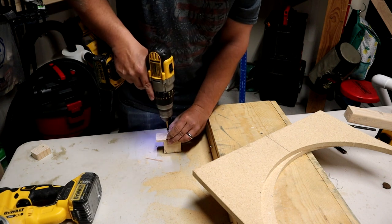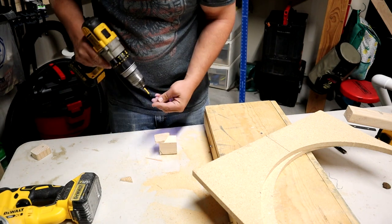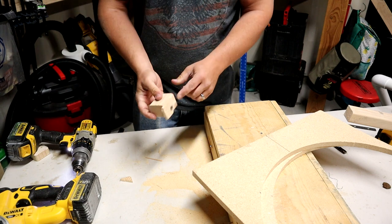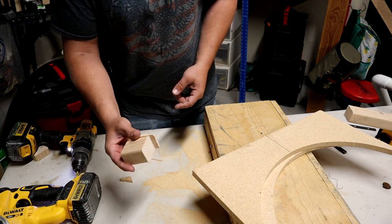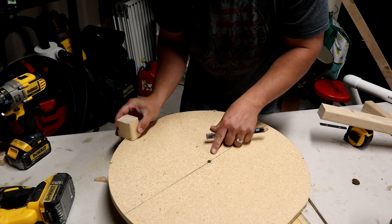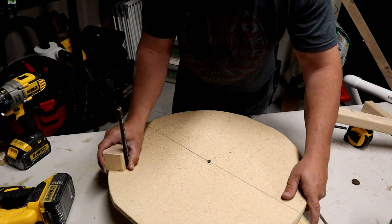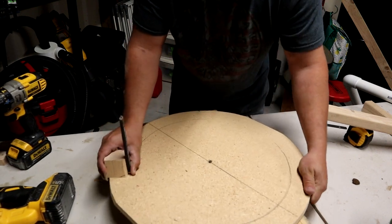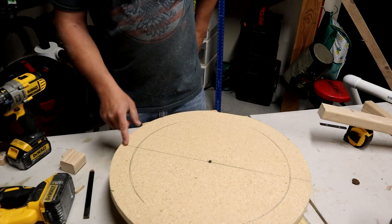Make sure we do this the right way — we're trying to capture this width here. We're going to go ahead and screw another piece of small scrap material just to get this width. This is really just a jig for making a mark with our pencil — a simple way to do it. We're just going to hold our pencil to the block like that, and then we have our runner on the bottom. We're just going to follow that curvature. It gives us a nice offset line.